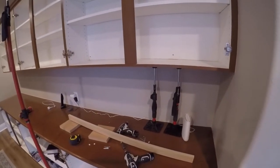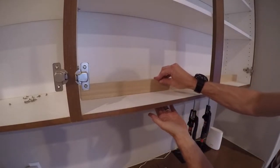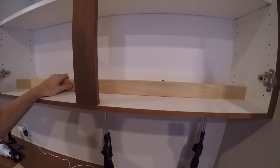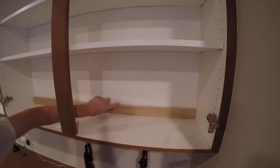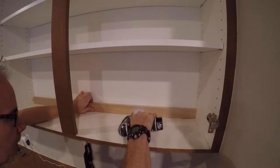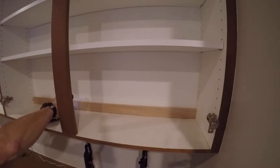This is the same method I'd use if I were installing new cabinets — I'd use these same type of jacks. When I drive it from underneath, this piece of wood is going to keep everything nice and flat. I want to make sure I drill down from the cabinet and counter-bore it, then vacuum it out. I also want to drill from underneath and counter-bore to make sure the screw heads sink in flush so the painters can fill them. While screwing this in, I want to make sure I don't push down on this board — I want to push up against the house and drive it in straight so the board does not conform to the sagging shelf.